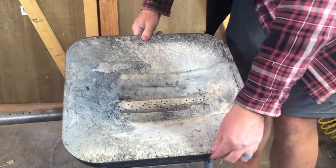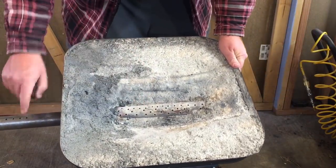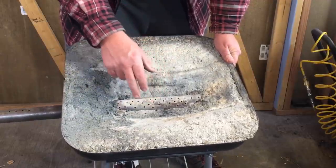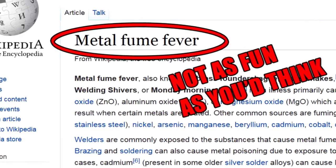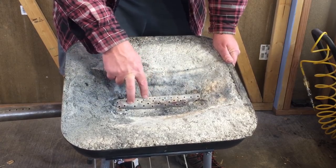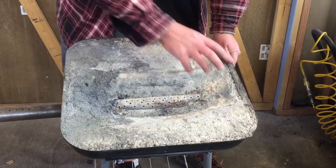You can kind of see what this looks like inside. It's built up all around here on the edges. It comes down to this pipe — a steel pipe. Never use galvanized for any part of this, but a non-galvanized steel pipe. You start heating this thing up with a galvanized pipe and you're going to have all kinds of poisonous fumes coming off of it. So this is my steel pipe — I knocked a bunch of holes in there with the drill, and this is just to maximize the amount of airflow that's going to be coming out into this area.